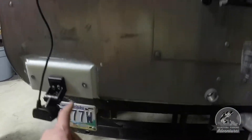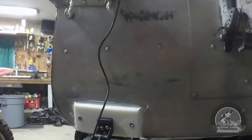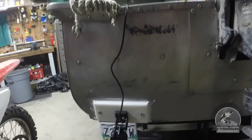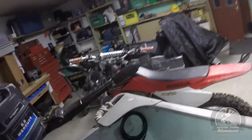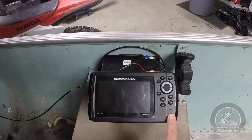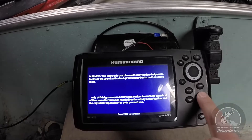Now that is locked on nice and tight, good to go, nice and level — looks pretty level with the boat right now. That's basically the finished product, so let's go over it one more time. It's a Teflon plate, two screws — the only screws that go in the boat. Everything is tight and sealed by silicone. The transducer is level, playing down with the boat, and it is on tight. Just got a little clip holding all the extra wire for the transducer, little 12-volt battery behind it — we are ready to rock and roll.